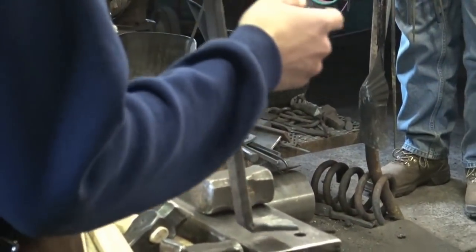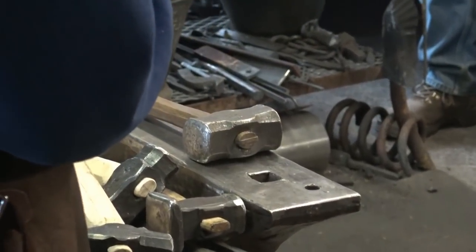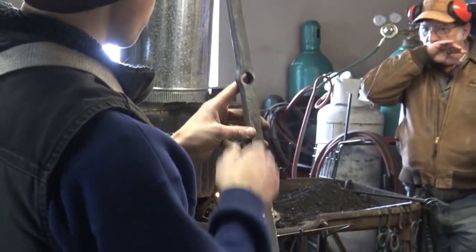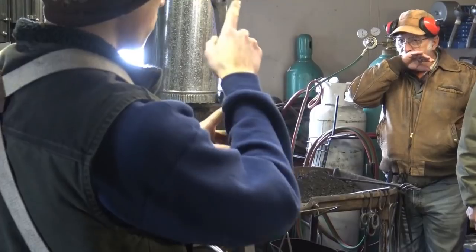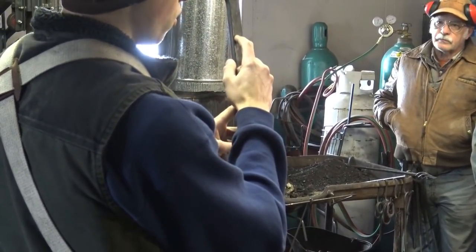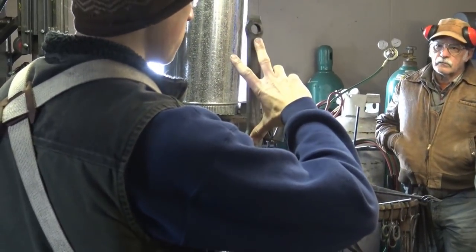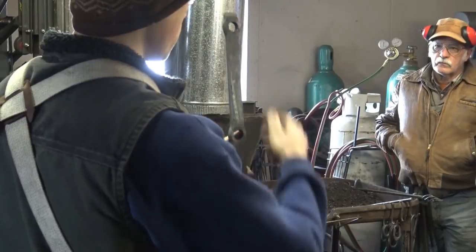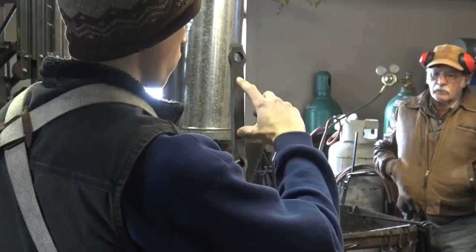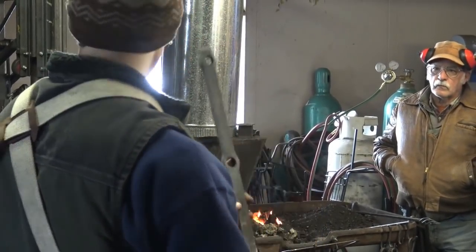And then the third leg where the tensioning handle will go, we're going to punch this closer hole to the heel, because the dimensions from the heel up to where each of the rivets are really important. So we'll punch this hole first, then we'll punch the hole for the tensioning arm. It doesn't really matter where that falls between the two rivets, and then we'll measure again from the heel up to this hole and punch it, just in case we have any growth or shrinkage from punching the hole for the tensioning arm.